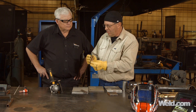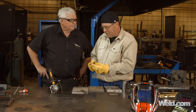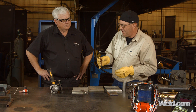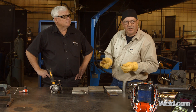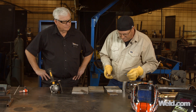Here's my copper tungsten holder — non-magnetized. This end is painted, so I wouldn't be able to tell what that was. I could see it's a fitting, but I really wouldn't know. But it has that copper color to it. If we ground on this, we're not going to get a spark — it doesn't have any carbon or steel to it, and that's where your spark is coming from.